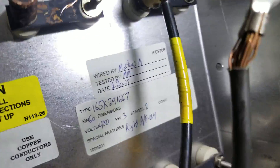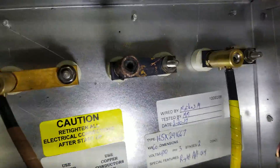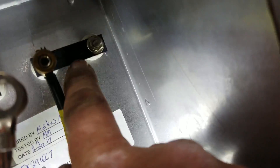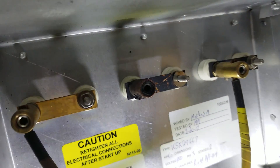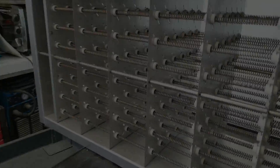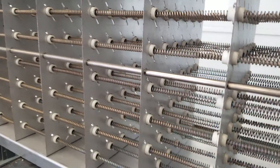That center one is really seized. The one on the left — look, that one's still tight, no discoloration. This one's loose — look at that bar, black. So anywhere the connections are loose, like these lugs and nuts — a lot of these nuts were really, really loose. Literally you could go in there with your hand and pull them off. You can see where that one is definitely arcing and making a bunch of heat.